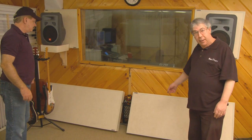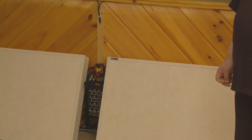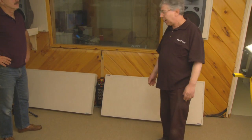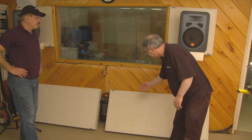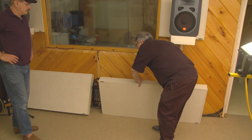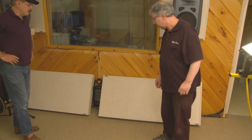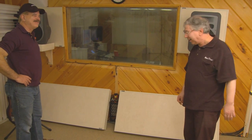These are Mondo traps in a very useful corner. I see this all the time in web forums helping people treat their rooms: they say 'I put bass traps in all four corners, I still have a problem, where can I go now?' I always say most rooms have 12 corners, and this is a very useful one. It does take up a little bit of space — about 13 inches of floor space — but in a room big enough that's not bad. It also hides your wires. There's still a fair amount of reflecting surface; this room is very tight and very clean but not dead.